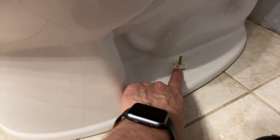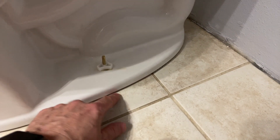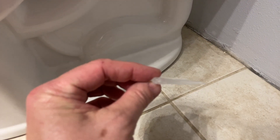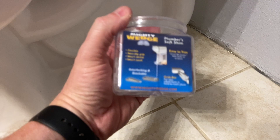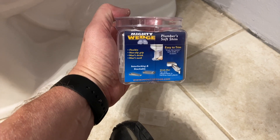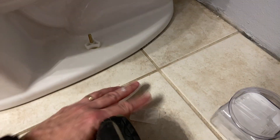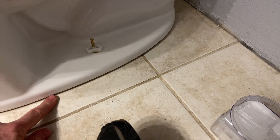The plastic nuts are meant to be hand-tightened, there's really no way to get a wrench on them. Between the weight and the nuts, it brought it down a little, but not completely flush with the floor. So I used a couple of plastic shims — the Mighty Wedge — one on each side. You can buy these at pretty much any big box store. I like these for this application more than a wooden one. This will allow us to shim it and keep it in place. You can also do an instant trim around the toilet for a nice finished look.